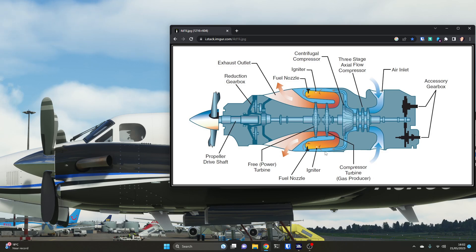When you are using the power levers in the cockpit, you are controlling the injection of fuel — allowing more fuel to be burnt to create higher pressure, to spin the engine faster, which then spins this axle faster. And then your RPM levers are controlling the gearbox that interfaces the free power turbine with the propeller. Obviously they can't be a direct drive between them because the torque would be enormous.